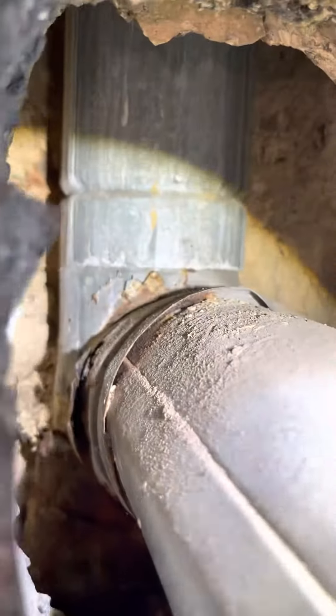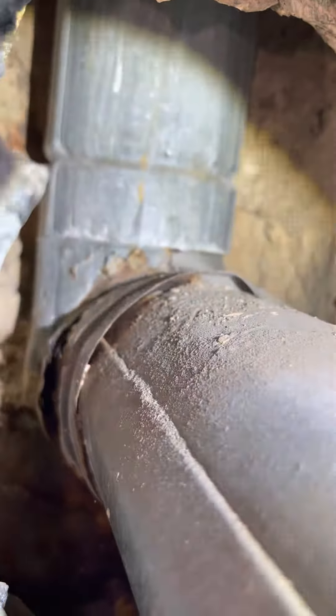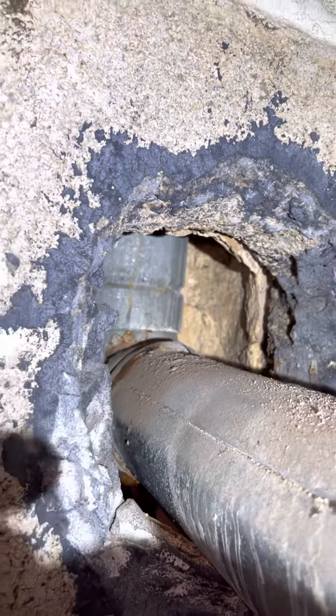The flue pipe is a challenge, so we need a chimney liner. It stays with an 80% furnace, so it's at 80 and it's got a lot of flue gas. Upon inspection I found that this is open — there's double-wall pipe but there is a big hole in the side of the pipe right inside there. Changing that out would be difficult, so I think what we need to do is just put a chimney liner inside of here.